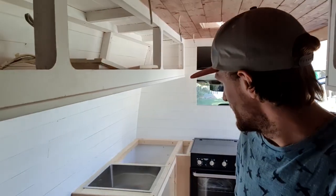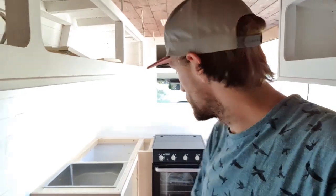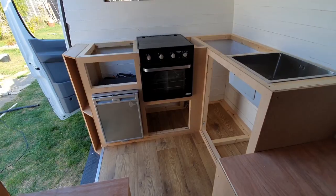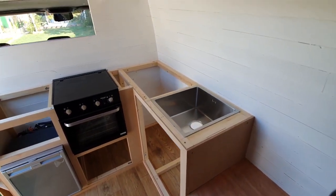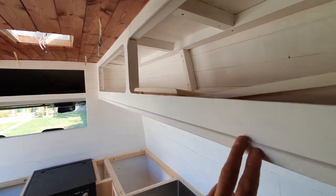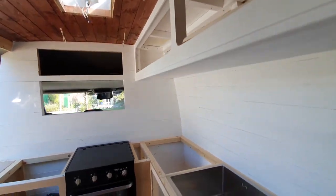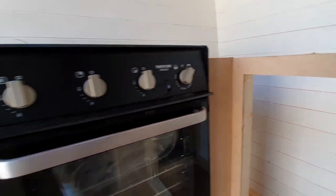I think I can say I've now completed the bulk of the carpentry work in the van. I've done all the fascia, done all the seating area, and all that leaves is to do all the tidy-up bits - the hinges, the brackets, get the cupboard doors on which are already made, get the drawers made. The kitchen's all faced up - I think it looks pucker. I've done it much the same as the high-level cupboards - I said 9mm before but it's actually 6mm MDF. I've just made a front panel for the whole kitchen area.